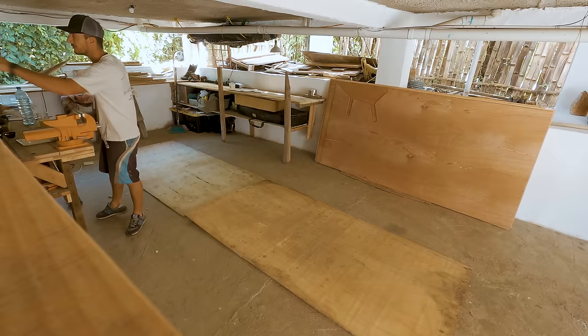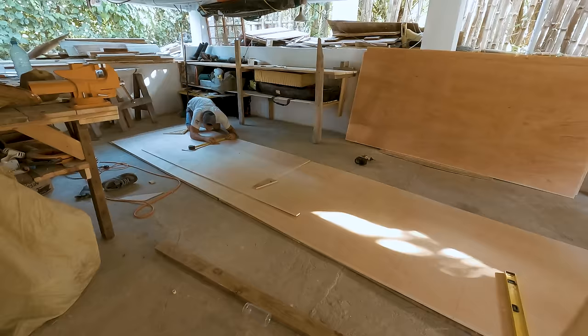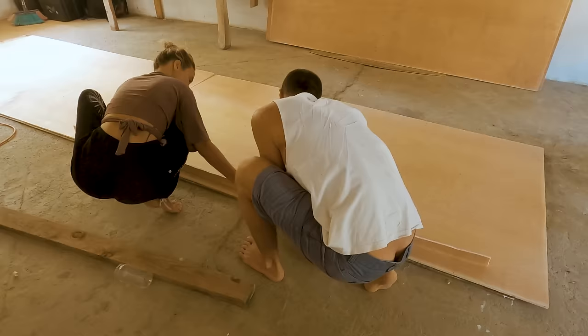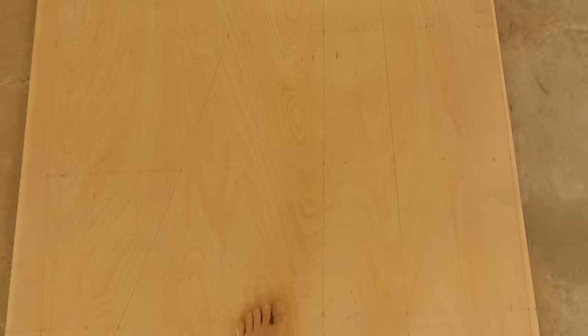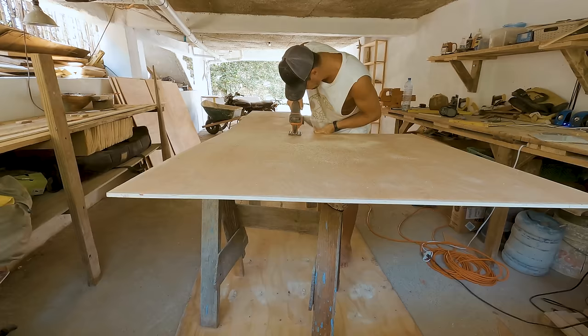In order to replicate the plan measurements to scale on plywood, a grid system with reference lines 10 centimeters apart is used. The plans give you a point on an x and y axis that can be translated onto the plywood. Once the points are measured, they can be connected together using a flexible ruler to create the proper curve. I made the ruler out of a piece of plywood. This process only has to be done for one side of the hull.